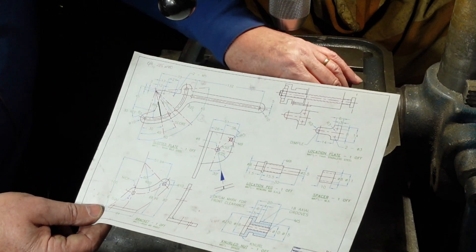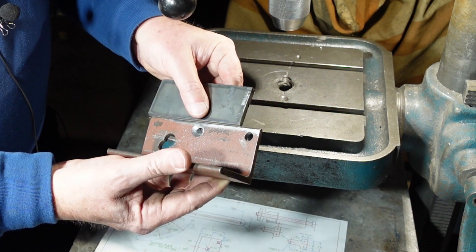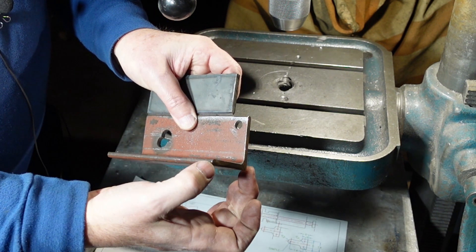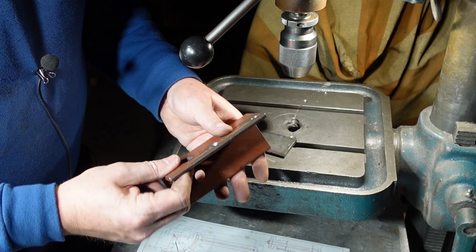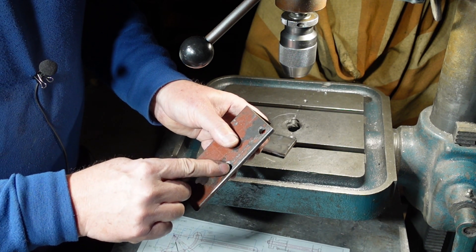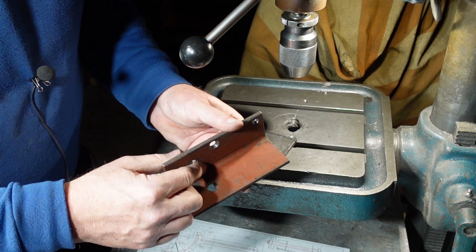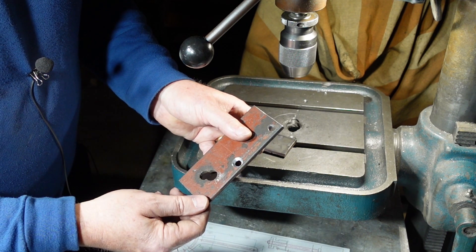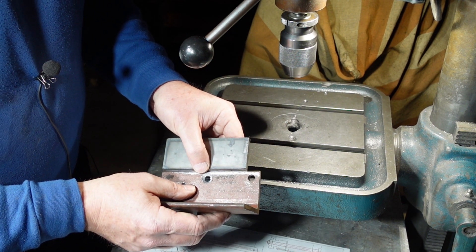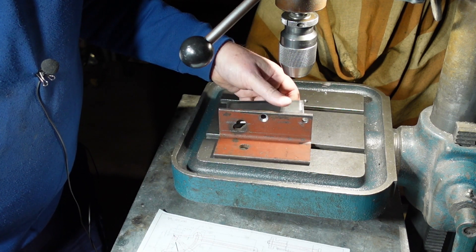What I've done is I've got a bit that's actually 55 by 55, but it'll do. I'm going to weld a piece of 6 flat on there and that will give me basically a 100 by 55 piece, so I can machine that down. This is a used piece from somewhere - there is one hole that's going to be in the way, so I've countersunk that and I'll put a block of aluminium behind it, fill it up with weld, flip over, do the same on the other side. Then I'll probably just use stick for that, fill the hole, and come back when it's cool and start cutting things out.